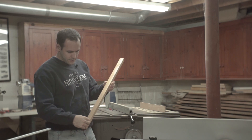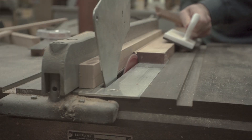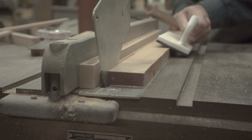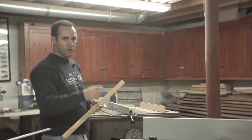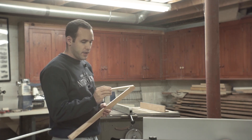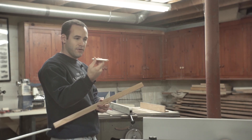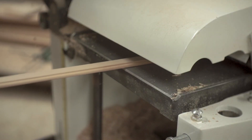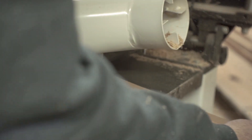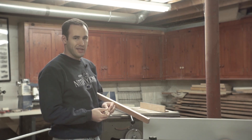After I got the bead molding at the bottom of the board at the router table, I brought it right over to the table saw and was able to just rip it off. I left it a little bit heavy so I could bring it over to the planer and plane it down to the thickness I wanted, which is about five-sixteenths of an inch — the depth that I thought looked the best. I did run into a little bit of tear-out issues running these little guys through the planer. Definitely had to watch my grain orientation, but luckily it was on the side facing the face frame so you're not really going to see it. Most of it was pretty usable, just a couple pieces I couldn't use.